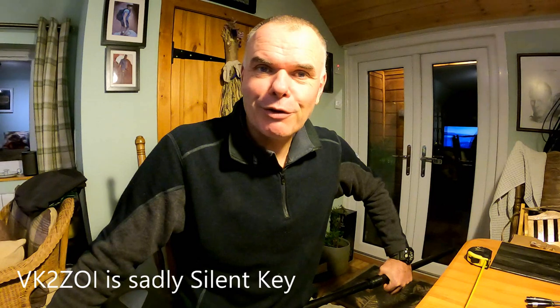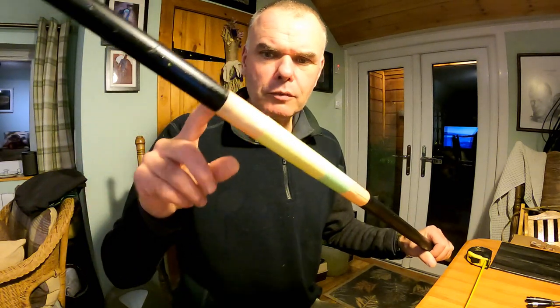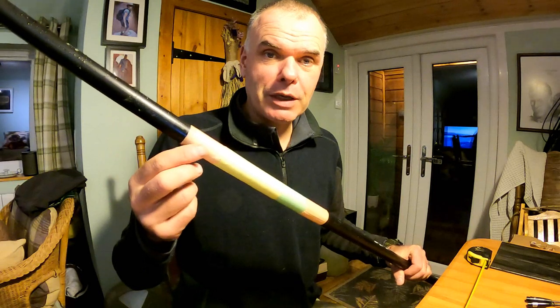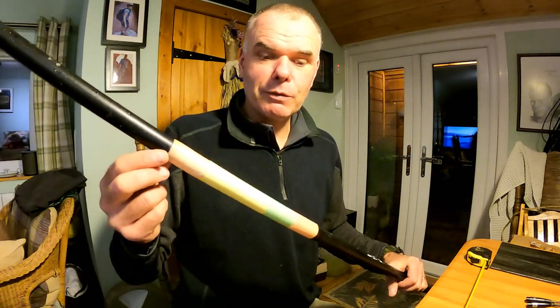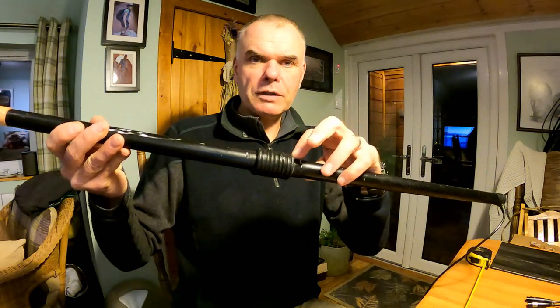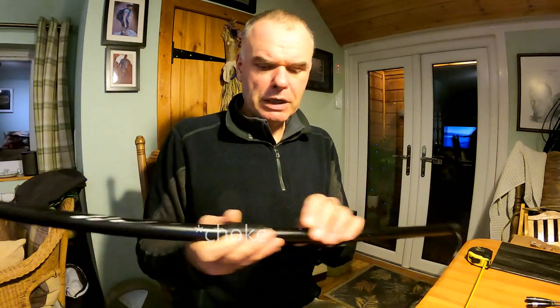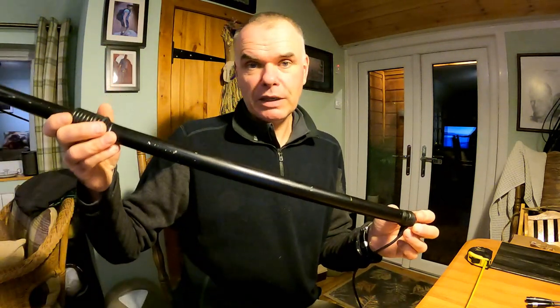Let's have a look at this half-wave vertical or flowerpot antenna. Everything you need to know about how to build one is in the details below the video. It was invented by VK2ZOI, and it tells you why he called it a flowerpot. This is my one here. Now this is a 2m and 70cm one. Underneath this multicolored duct tape is some aluminium foil, which basically forms a phasing section for 70cm. The actual antenna ends here, after this trap, and it is about a metre long as you would expect — it is a half wave for 2m. Mine has an extension on it for mounting in the rucksack. You can make this any length you like; mine is 50cm long.